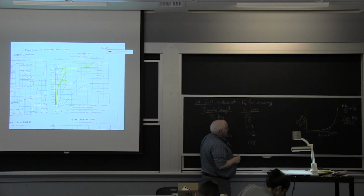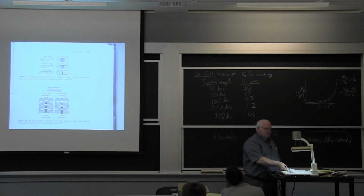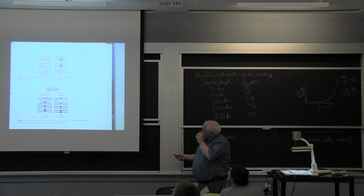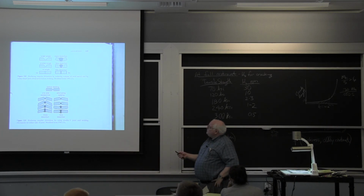It turns out that if I start looking at the steels, I put this up earlier. If I look at full restraint, what do I mean by full restraint? Well, when you weld steel or aluminum, this actually was done for aluminum. This comes out of Sindo's book, I think. And you have a large angle, you get lots of distortion because as the aluminum shrinks 6% on solidification, the steel shrinks like 3.2% or something on solidification. So aluminum distorts more than steel because it shrinks more, but if you put in a V-shape weld, which you need for access to get the heat down to the bottom, you'll end up shrinking more at the top and you will end up with something that distorts.